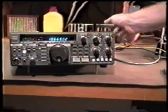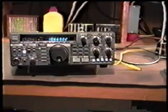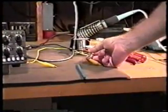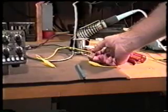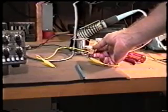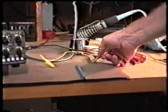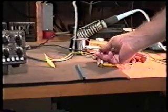And then we can pull our antenna connector out. And you can actually feel the resistor when you're through it. It'll be quite warm because of the current that's passed through it. That's why we want to use the highest wattage resistor possible, because this does get quite warm and we need to dissipate that current. So we don't want to use anything like a 1 watt or a half watt resistor. We must have at least a 2 to 5 watt resistor.